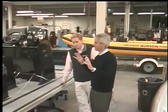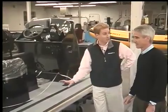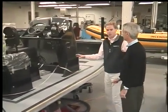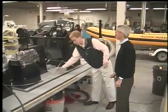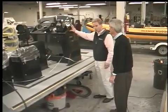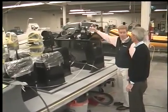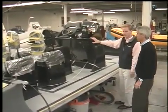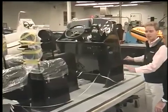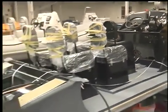Let's go from this to maybe one that's a little bit further down the road and just keep following the progression. Matthew, here we are at a boat that's a little further down the line of being finished. We still don't have the tube on this boat right now. We're at the point now where we've bedded down the deck panel, so the fuel tanks are below here. We've got it all bedded down and caulked. We've now added the console, seating, and done the initial install on gauges, electronics, the GPS, throttles, everything like that. Cables have been run. The next step would be we would start doing engines. So this boat's all set for engines.